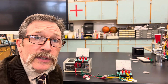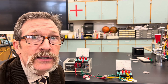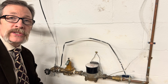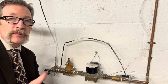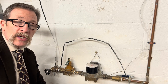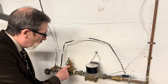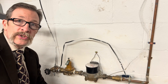We use high voltage and take it down to low voltage — if we didn't, bad things would happen. Here's where the water comes in from the municipality at about 120 PSI, which matches our 120 volts in the analogy. It's actually probably about 95 to 100 PSI — way too much for the system. This is a pressure regulator that takes that 95 PSI down to about 45 PSI, which is what you want for residential. It acts just like a voltage regulator in an electrical system. Let's take this one apart and show you how it works.